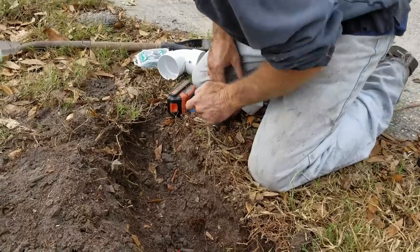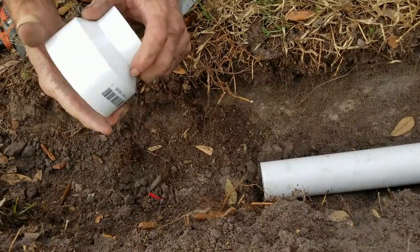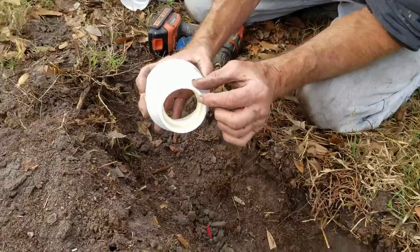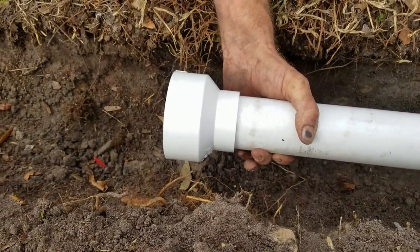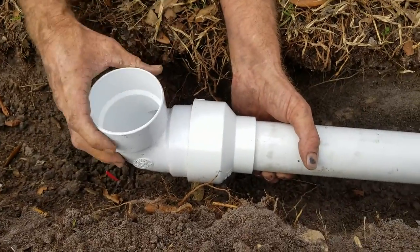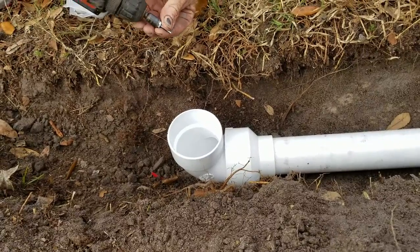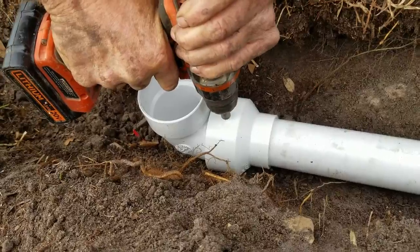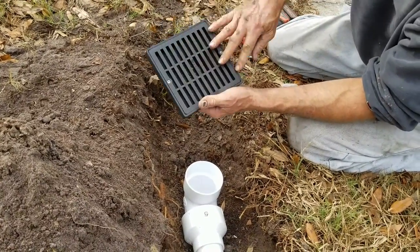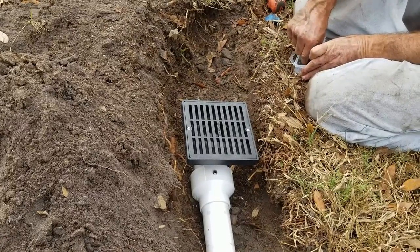Using the two-inch, the discharge connection is a little different. This is a two-by-three-inch adapter but this is schedule 40. Glue that up - it's a really small coupling, makes it hard to make it secure. This is thin-wall PVC that's actually going to slide inside the coupling - it's an almost exact fit. We're not going to glue that; instead we're going to put a set screw in there to hold it in place. Then we're going to put our grate on top - this has a three or four-inch opening with basically a five-inch drain on top. That's the discharge, and we'll set that in with a set screw as well, because that pump is pretty powerful and could blow it right off.